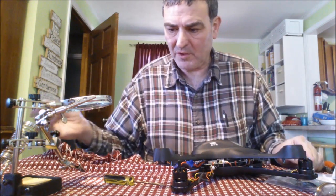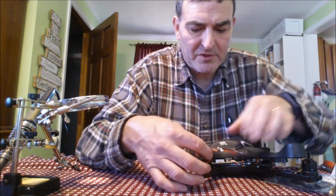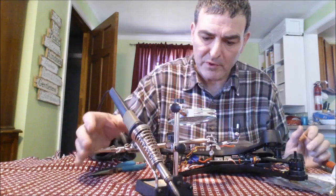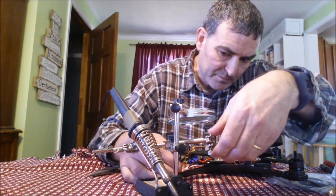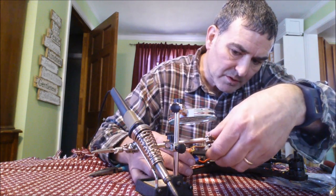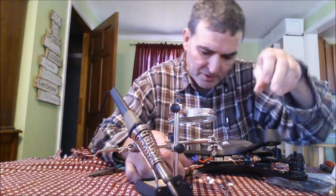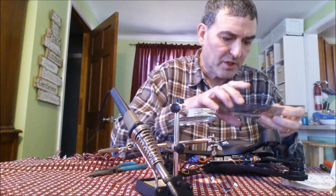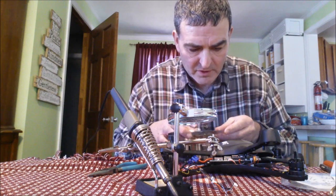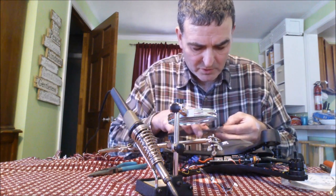The red wire is done. I did the black wire the same way, and that's off. Now before I unsolder the old board, I decided to put the old one to the side and take the new ESC and solder the red and black wires onto it first, while I remembered which was red and which was black.